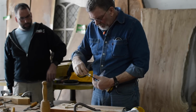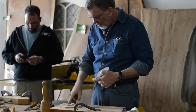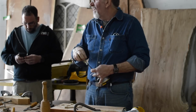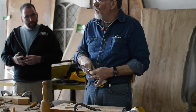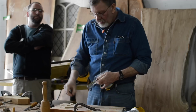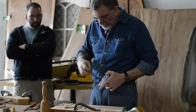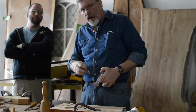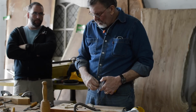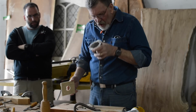If I had it, I would have probably made this out of some clear plexiglass or whatever, but the hardboard works pretty well too. And this is good for anything, if you have some dowels or wood plugs, the ends of through tenons, anything where you have one part of a joint sticking up from the surface and you want to flush it. And it's end grain or something that's kind of difficult to just plane off.